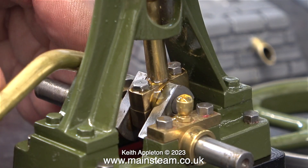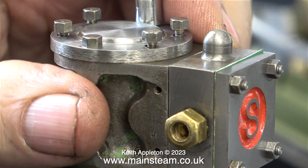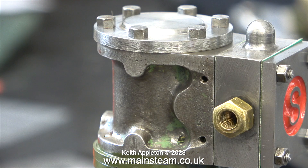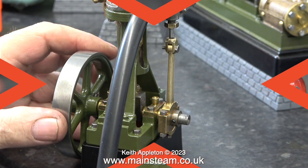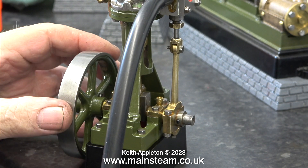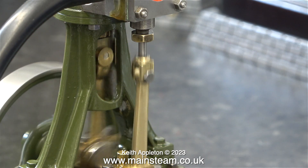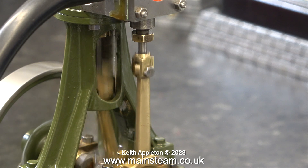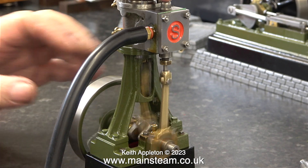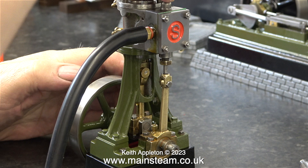Time to oil the engine. It's very important with steam engines or any other mechanical device that there's plenty of lubrication between the moving parts. I still haven't turned the valve around, so it's not in the right position yet. I haven't fully finished cleaning up the cylinder cover — it needs cleaning up around the edge a bit more and it needs a gasket making for it too. This clip illustrates that at each end of the stroke there's a really big blow to exhaust at both ends. But miraculously, the engine runs anyway — and it runs well. It is, after all, quite well made, apart from the centre boss of the flywheel that could do with truing up. The problem is this engine would use too much steam and not give sufficient power, wasting steam at each end of the stroke. I will address this in the next episode, and with a bit of luck my voice should have returned to normal by then.